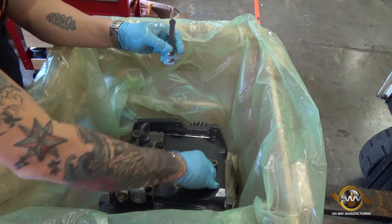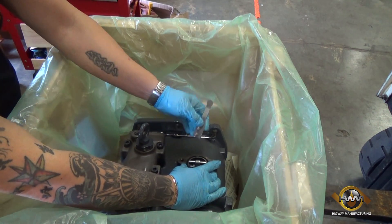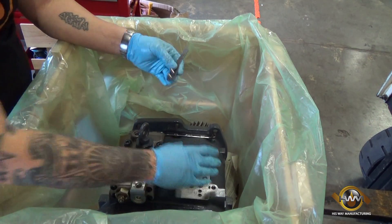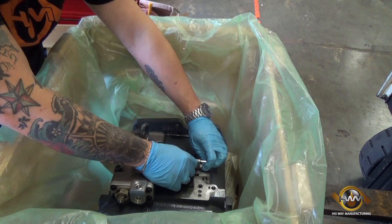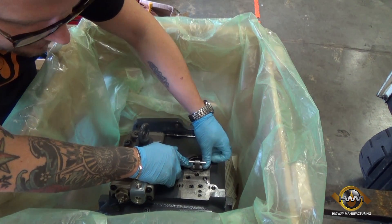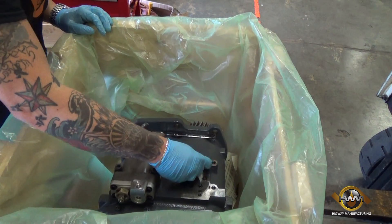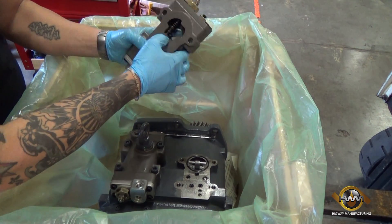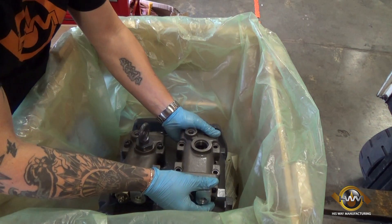On this horseshoe that attaches to the swash plate, as it's moving back and forth to get your swash plate online, the leg on the sensor type uses that function with the electronics. We're removing this piece and making sure that this horseshoe is aligning back into the spot where it was properly set. This post at the bottom is a keyed post with flat sides on both sides to make sure you align it properly to get back into that pump housing. Once snapped in securely on your horseshoe, we're going to align the servos or pistons inside the regulator to make sure everything is as it should be.